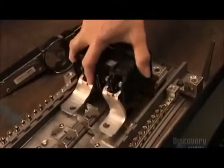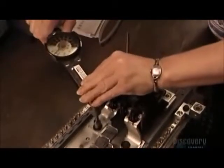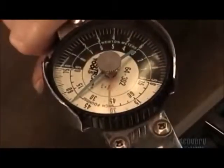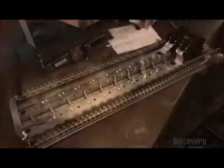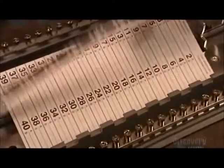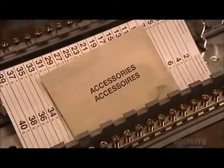Next comes the main breaker. Its maximum capacity is 200 amps — the units of measurement for electrical current. If demand exceeds maximum capacity, it'll trip, meaning it'll turn off all power in the home. The worker makes sure it's sufficiently tight so that vibrations caused by street traffic won't loosen it. She also encloses labels to mark the breaker's pathways and an envelope with installation screws.